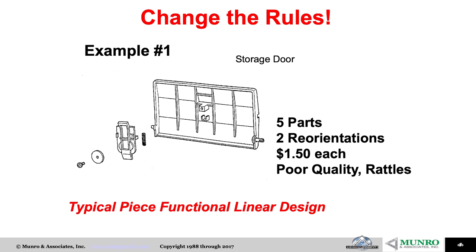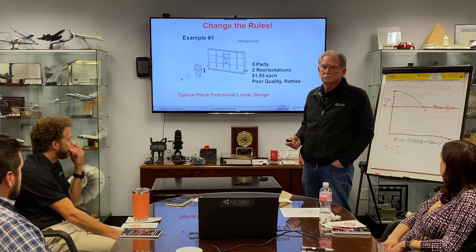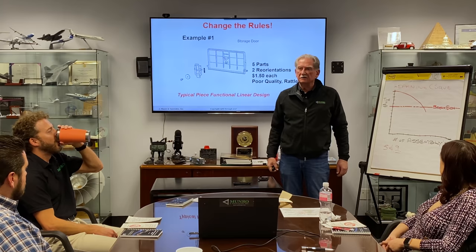We wanted to be able to take it apart because at the end of World War II, they made the decision that we need to be able to take our crappy products apart faster. So let's make a 60-degree angle. The stuff that came out of England and whatnot, that was tough because it had an Acme thread or a Whitworth thread, and that was a locking angle. It would go down, but it took a gorilla to get it to pieces.